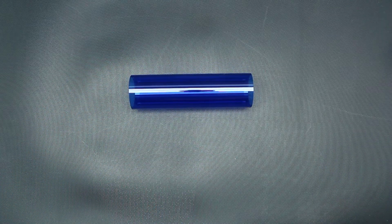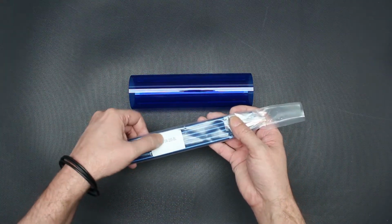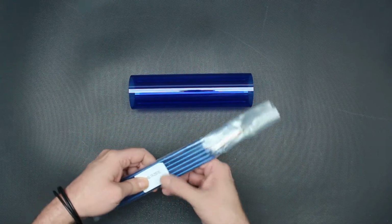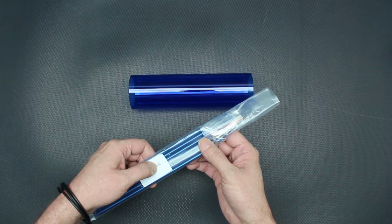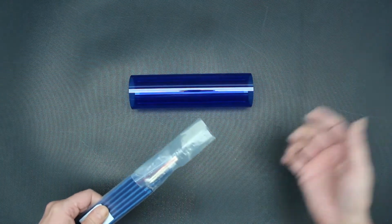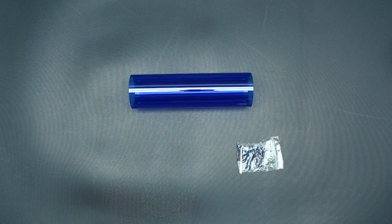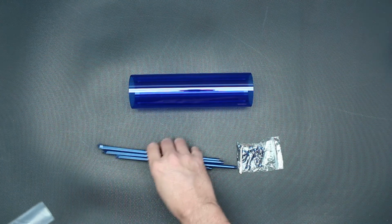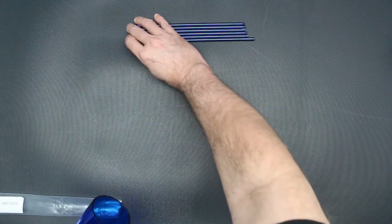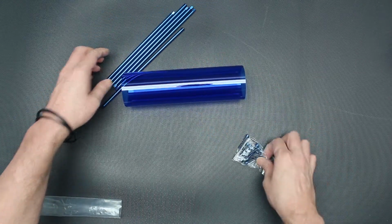We're going to be using 200mm blue tension rods. Part number again, TR for tension rods, 200 for the millimeters in length, and blue for the color. Anytime you see the last 2 digits are a letter color code like that, BL for blue, RD for red, MB for matte black, etc. These are the screws that come with it. The tension rods, go ahead and set those up there for now, and the tube, so you can keep everything from rolling off the desk here.